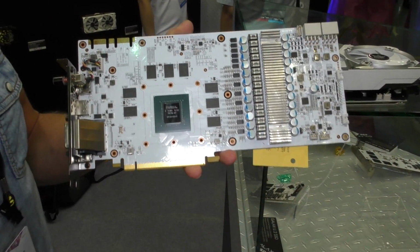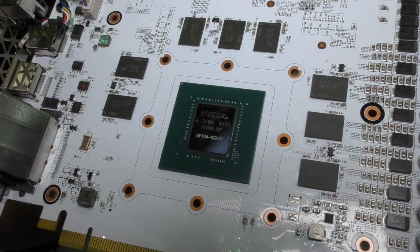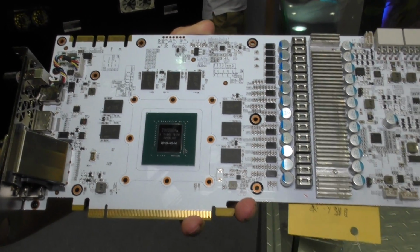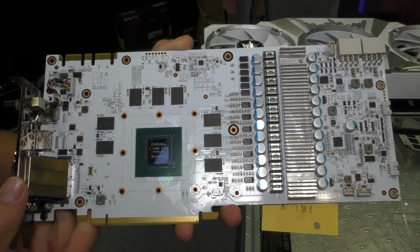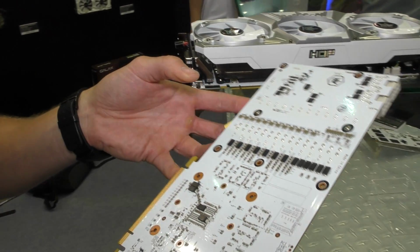I don't really think so. The only difference between the reference and the custom is that the reference was using analog PWM, and we are using digital. It makes it easier for us to push the voltage or the GPU clock in terms of software application. I'm sure there are some limitations in either the BIOS or the driver, which probably lock something up. But I'm quite sure that's what everybody gets. Okay, so there's no real reason to be afraid that the one 8-pin power connector and the PCI Express bus won't be enough. No, I don't worry too much about it.